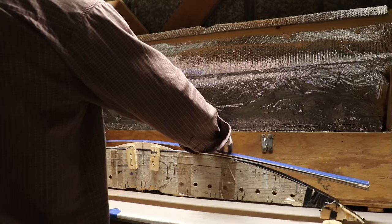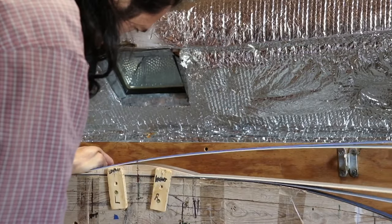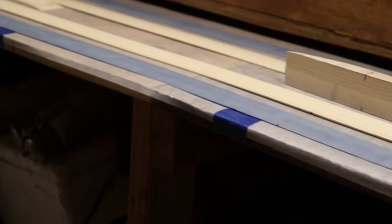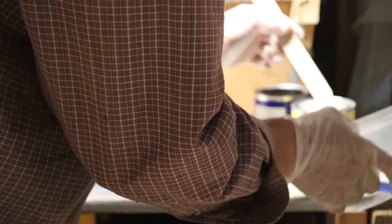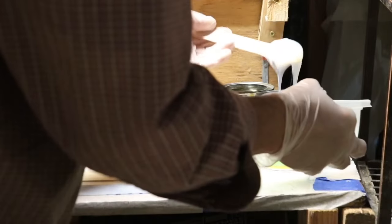The glue-up can be a little hectic at times. Here I'm just making sure it's fitting nice around the riser and that my glue lines will be nice and clean. Get your epoxy opened up and dish out equal parts of each — the A and the B. I like to do five scoops of each with large popsicle sticks for my small bows, so it's equal parts A and B, five scoops of each. Then you need to mix the two together for a solid three minutes.